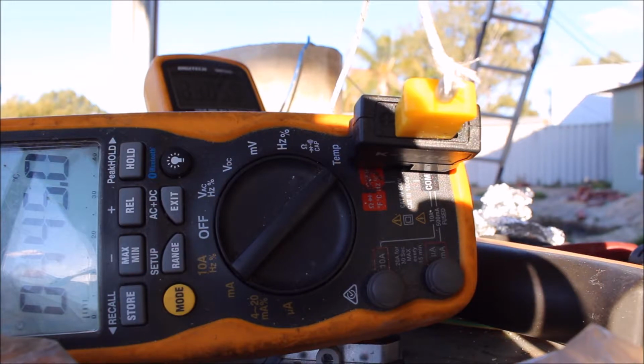Got a little puff of smoke, so that's good. Something's burning off, probably some plastic from early on, or a bit of wood, a bit of sticky tape on one of the pieces of aluminium. Getting closer to 500. It has to stabilize at above 600 degrees, so I'm going for about 650. Our current's dropped down to 12.9 amps. Obviously the coils are getting a bit hotter, 480 degrees.